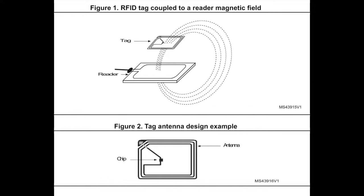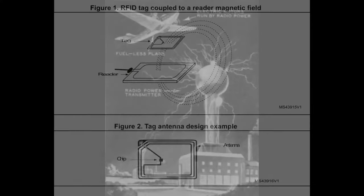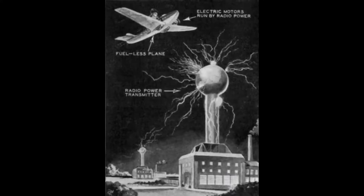and it's used both for powering the chip, so you don't need an external battery. It's very thin because there's no battery to manage, and you don't need solar or light for a solar panel. It's also used for reading and writing data. These modern tags read and write data very fast — like five milliseconds — so really you can tap to get all the information without having to sit there and hold it. It's very fast because it's over 13.56 megahertz. It's like Tesla's dream of wireless power — every day we honor him by using RFID tags.